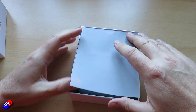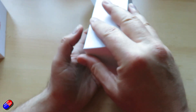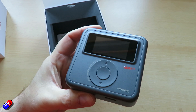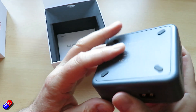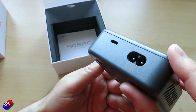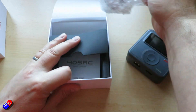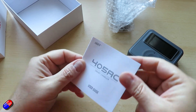Output voltage is 5 to 18.5 volts, charging current is 0.1 to 5 amps, discharging current is 0.1 to 1 amp, maximum charge power is 60 watts, maximum discharge power is only 5 watts, and balance current is 0.2 amps per cell — so balancing will take a while. All the basics are covered, but the challenge is that some of the more advanced features found in modern chargers, like the ability to do more complex functions, just aren't really here.